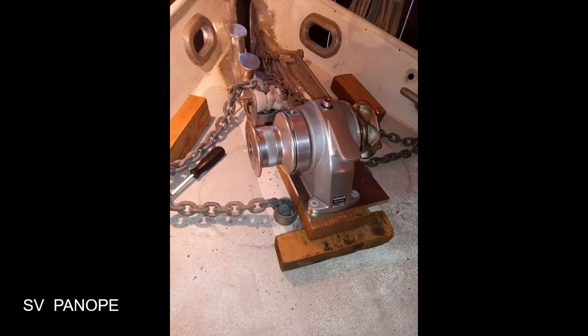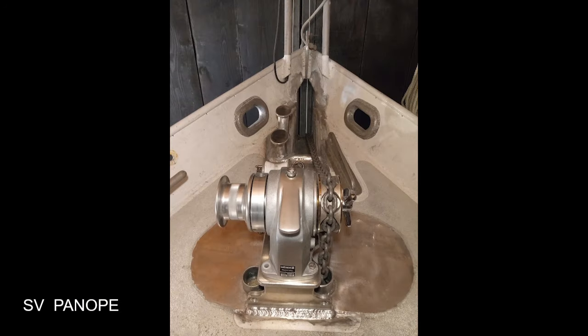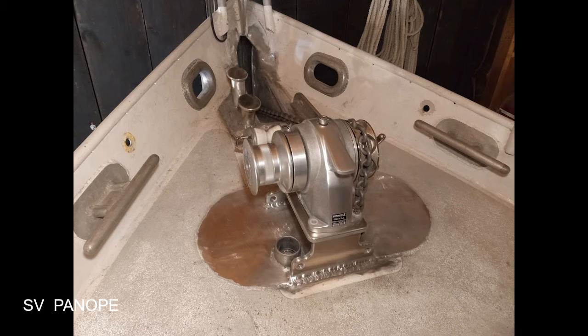So in spite of my best efforts to ensure that the new smaller chain would work in the old windlass's chain wheel, it was a bust and the chain was skipping on deployment. Now I chose a Lofrans Royal to replace the old Simpson Lawrence 555 windlass, and it's working out just fine. It's only single speed, but it seems to be a nice compromise. It's not too slow coming up, but it does have adequate power.